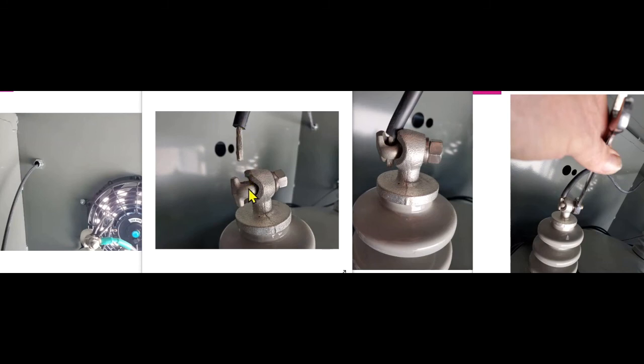You insert your wire down through that opening, as we can see in the next picture here. You want to make sure that you've got enough insulation stripped off so that the insulation doesn't get between the eye and the block behind it, and of course insulating the wire from making contact with that post. Just make sure that it's stripped off enough there. Put it back in, in other words, shove that in, tighten it down by hand, and then take a 9/16 wrench and finish tightening that eye bolt back up so you have good contact on that high voltage transfer cable.